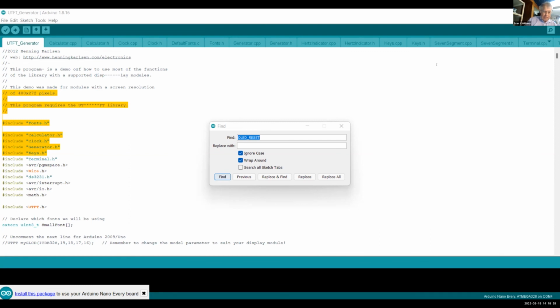So this was all very fun to program, but loop is another entry point. So there are two important entry points in the C++ of the Arduino. One is setup, where you set the stage, as it were. The other is loop, and loop constantly repeats. As the Arduino runs, it constantly repeats the loop. There's no other operating system on Arduino. This is why it's preferable to Raspberry Pi or some of the other embedded boards, because it takes all the operating system, all the Linux, everything out of it. And all I'm doing here, step 1, I'm blinking the LED. Step 2, I'm reading the push buttons to see if they were set. Step 3 or 4, I'm going to my clock read time, and I'm going to my clock display time.